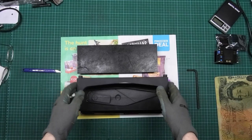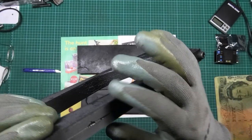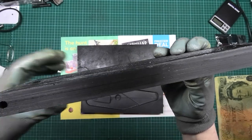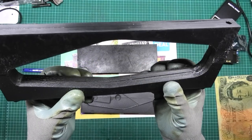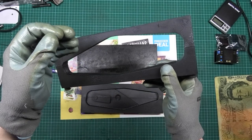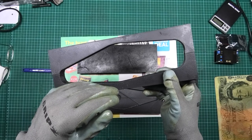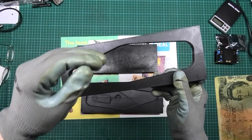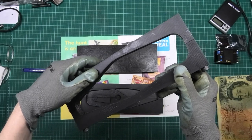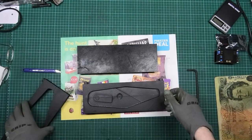I'm ready to do the last bit. This is separated here but it's not too bad on the inside - it is actually glued together, it is in one piece. What happened was when I was printing the extruder was clicking, which usually means the nozzle's too close to the print, but in actual fact I ramped the speed up and it just couldn't extrude quick enough.